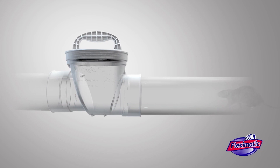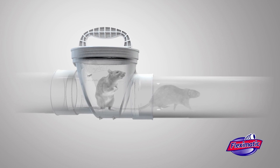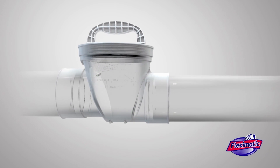It is common for bugs and rodents to enter your home from the main sanitary sewer pipe. The backwater valve flap only opens in one direction, so it completely blocks their access, also preventing the entry of harmful gases and bad odors coming from the sewage.